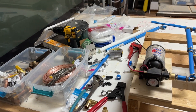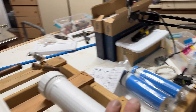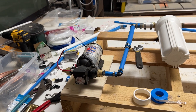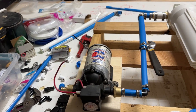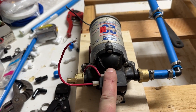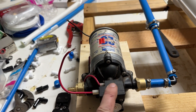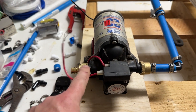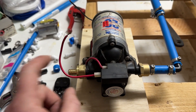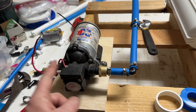I'm going to start by digging some things out and putting a few things together, and then I'll show you the plan once I have one. This is a lot of bins filled with fittings that I've been digging through to try to find just the right pieces without going to the store. But I actually think I spent more money using what I have than if I would have just gone to the store. I have an RV pump here — it's a 12-volt pump, so I can power it from any of my little battery power units, car battery, solar, or whatever. I've got PEX fittings on here, half-inch threaded fittings on each side. I've got half-inch PEX I'm going to run. This will go to our barrel full of sap and pump the liquid through.